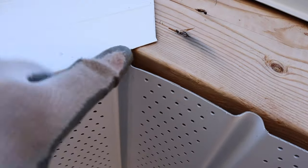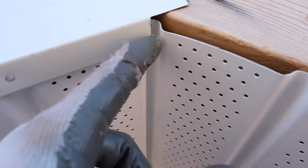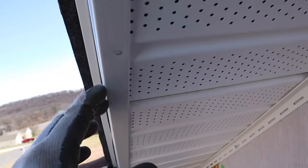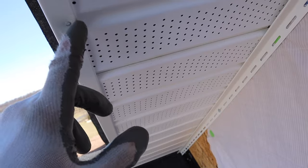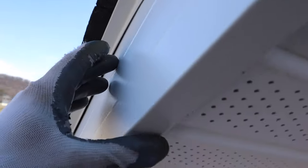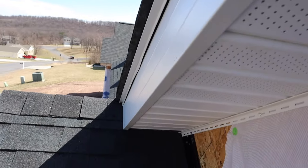Here's this piece installed. That is how you want it to look — you want it to keep running past and right there is the very peak. The next piece that comes over is going to lap over and give you plenty of room for a nice-looking joint. For nailing, nail up underneath and try to hit the grooves so it doesn't fold up the soffit. Nail from the drip edge into the fascia and try to keep nails out of the face of the fascia to avoid an oil-can wavy look.